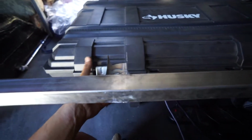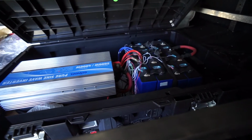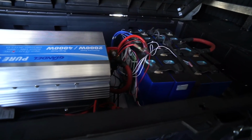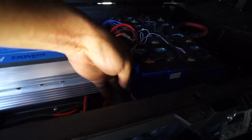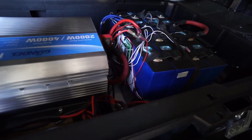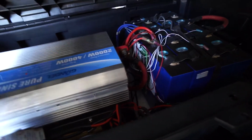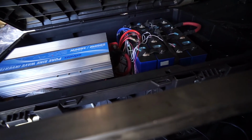But yeah, and then I just need to unlatch my battery box like this, open it up, and boom, I have full access. So that's gonna be way more helpful. Hopefully all this stuff looks okay. I haven't checked my batteries in a really long time, but it does look like there's some warping going on in this first cell. Maybe it's swollen a little bit? It has been really hot, and this first cell usually gets most of the stress from charging and discharging, so hopefully that's alright. But the BMS does say that one cell has some over voltage on it, but you know, whatever.